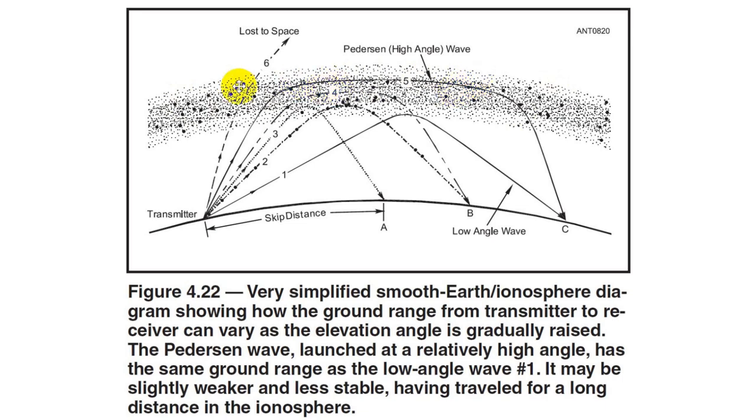All of that swirls around in the Earth's magnetic field — the positive charges go one way and the negatively charged go another. In radio, if the frequency is too high or the angle is too high, it'll go right through the ionosphere. If the angle is right, it'll come up and be refracted back down to the ground. A single radio wave from a transmitter can take multiple paths to a listening station, and these multiple waves will sometimes cancel and sometimes reinforce each other — that's what leads to fading.